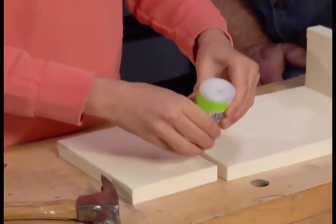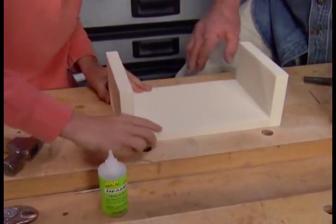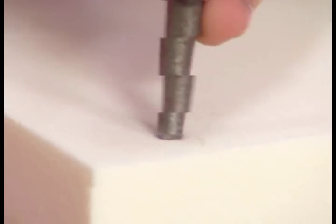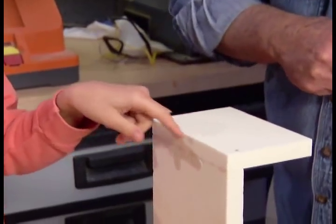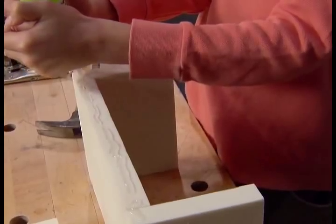Just a little bit, and there you go. The great thing about this non-toxic, vegetable oil-based polyurethane is that it's biodegradable and can be attached with wood glue, epoxy, polyurethane, or hot melt adhesive, as well as screws and nails. Next, we use a nail set to countersink the heads below the surface. We'll have to fill those holes too. We repeat the nailing and gluing process for the remaining sides of the box.